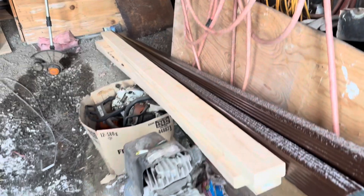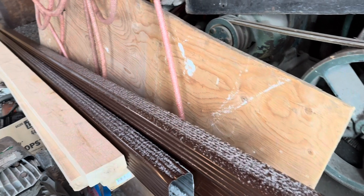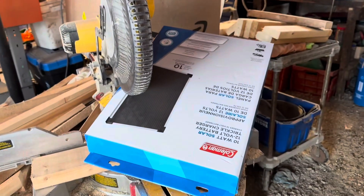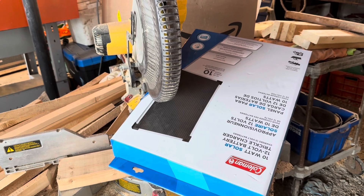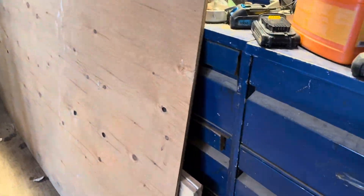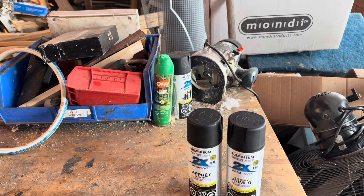Okay, so we're back in the shop and we're going to need a few 2x4s for this project. I bought these downspouts here — these are 2x3, and they're brown. I will be painting them flat black. Everything will be painted flat black except the glass, to absorb as much of the heat of the sun's rays as we can. I have a 10-watt solar panel to run the computer fan that will allow the air to flow through the air heater. We have our piece of glass here, which we haven't taken measurements of yet. We've got a piece of half-inch plywood and some foil-backed insulation — rigid insulation, 3-quarter inch — to insulate the back. You're also going to need some flat black paint, possibly some silicone, and don't forget the computer fan.